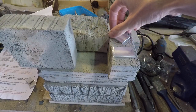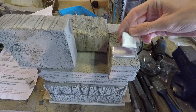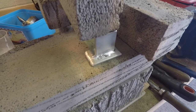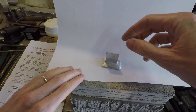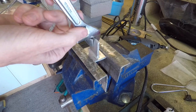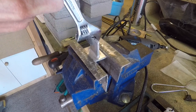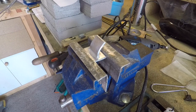I'm going to do one final experiment. I've put some effort into cleaning the surface with the stainless steel rotary tool, and re-reading the instructions I'm going to tin both surfaces first this time. I also ran over the joint with a stainless steel screwdriver as described in the instructions. Here's the finished joint — a bit untidy, but I'm putting quite a bit of force into it and it's certainly holding. I can actually feel the aluminium bending rather than the joint — and look at that, it's held. That's a good strong joint.